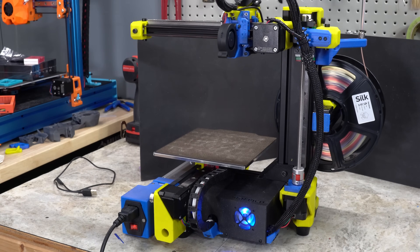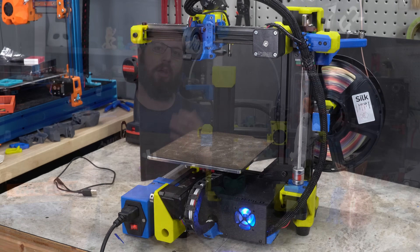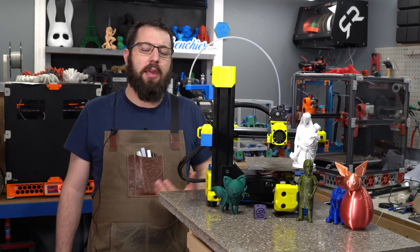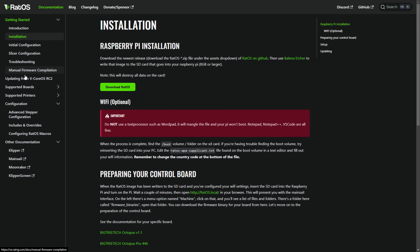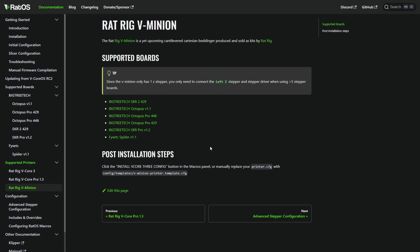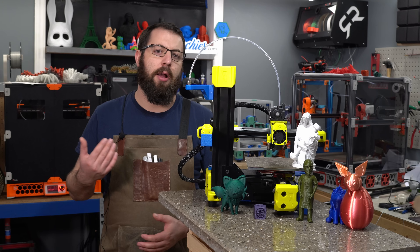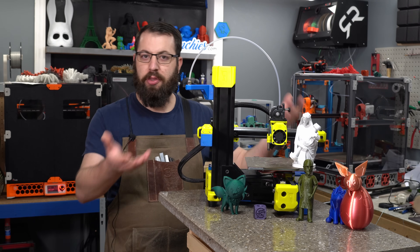Another change I did is with the bed wire routing. The original design just has an umbilical coming from the bed, and I really don't like bed wires flopping around. So as part of my electronics box design, I incorporated a drag chain holder. I am running Mainsail — for those that are building a stock RatRig machine, they do have what's called RatOS, which is their own flavor of Mainsail designed specifically for the RatRig machines, allowing you to easily set up your machine using options for machine size, type, etc. Since I wasn't building a stock RatRig with stock electronics, I went with the more contemporary Mainsail installation and created my own configuration for this printer.